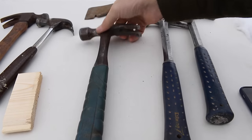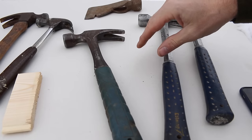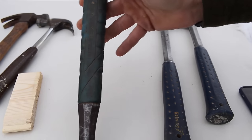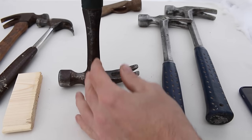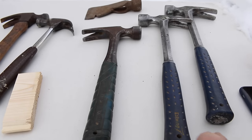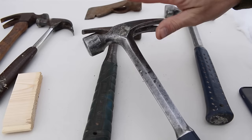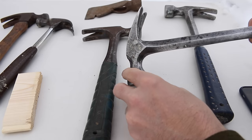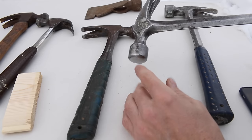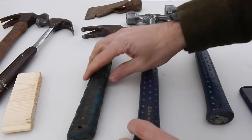Also think about having hammers specific to your job. If you're an electrician or an apprentice doing electrical work, one thing I do is find out the height of the electrical boxes I'm going to be setting — potentially hundreds or thousands of them. I get a hammer that's the right height, because I use it to set my electrical boxes: sit it up against the wall and it's the perfect height. Just set the box on top. Another feature to look for is a good flat surface on the side of the hammer that you can use as a striking face in tight spots — between a joist, for example — where you can't get a full swing. Turn the hammer sideways and use that flat face to get the job done.